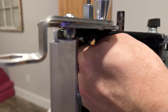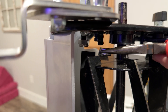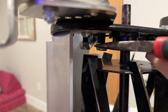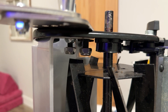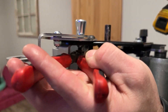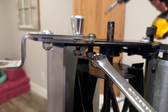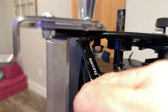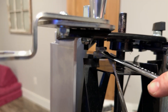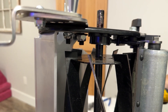Once you get it started, be careful not to cut your hands on the reel blade — it's not super sharp, but just be careful. Then we're going to get this one over here. This is where the drill comes in super handy. Grab the nut with needle nose pliers, take your 17mm wrench, and just easily tighten this up. Get it close but not all the way snug yet. Then flip it over to the other side.